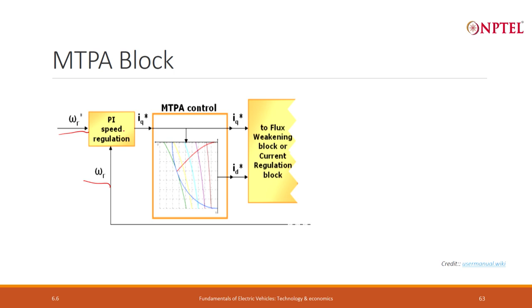If the signal is moving up and down due to noise, between two successive instances the true signal may only be slightly different, but because of noise I will think the error is going up sharply. If the interval is one millisecond and I extrapolate the rate of change to one second, I will say the next-second error is going to be enormous — and I will violently over-correct. So unless I have a perfectly noise-free environment, it is very dangerous to use the D term. We always avoid it and only use P and I.